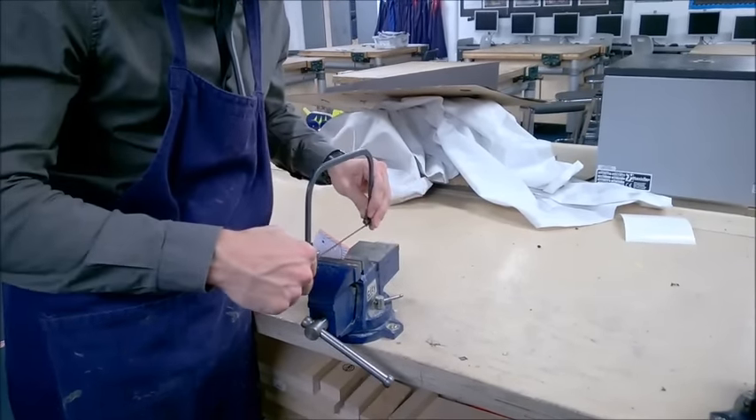When I start cutting, I put my thumbnail down on the surface — I'm not going to cut my thumb — and bring the saw, holding it at 90 degrees, lightly backwards next to my thumb. I do this about three or four times and it makes a tiny little groove in the acrylic. Then the saw sits into that groove quite nicely and stops it sliding around.